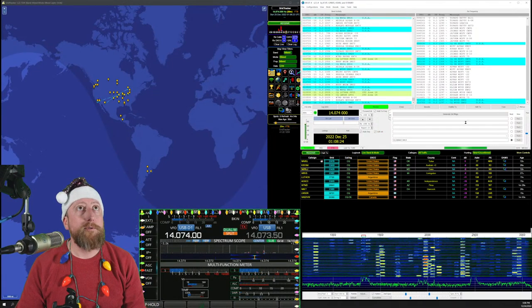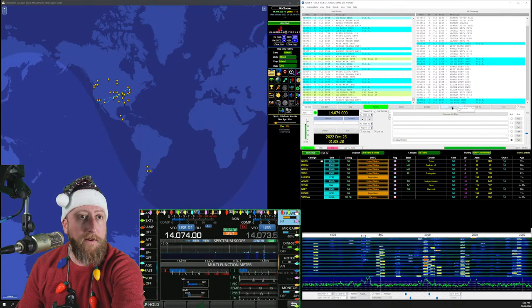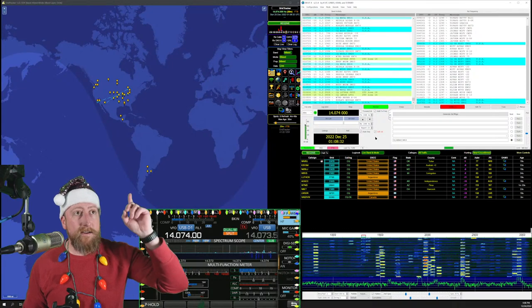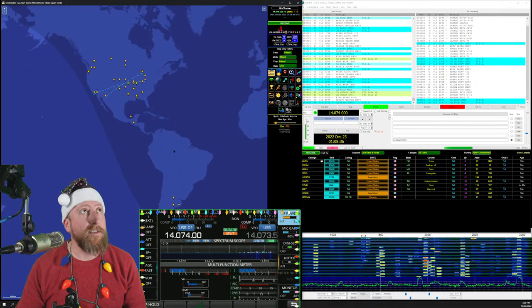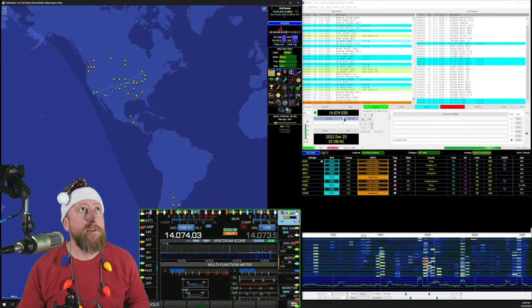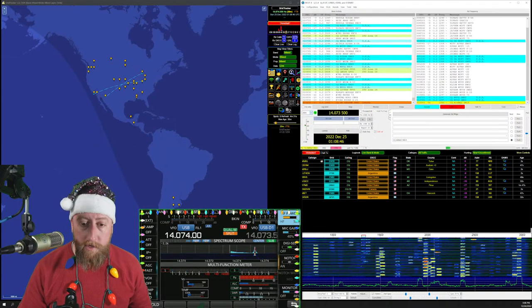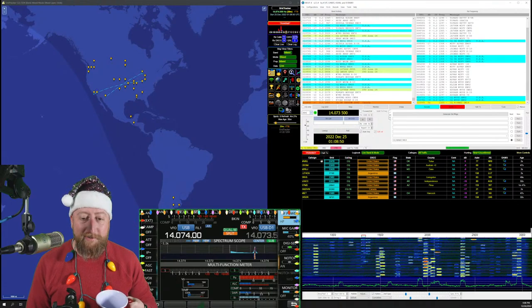Okay, cool. We're going to start at 50 watts of power output. You can see that there, and we're going to see how we do. Pink lines above my head on the map are going to be people that can hear me on the Christmas lights. We will begin transmitting momentarily. And, of course, if you hear me, say something. Reach out. And we are transmitting now. SWR just shot right up. That's not good.